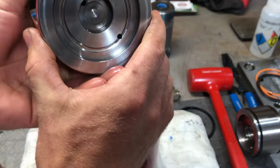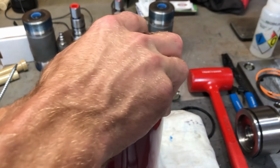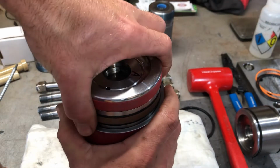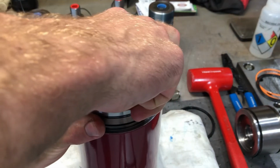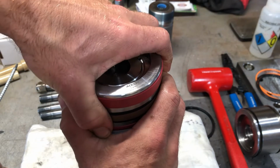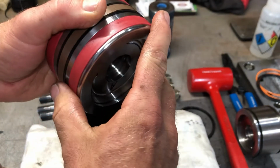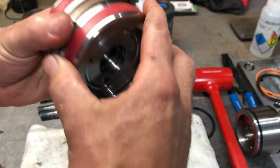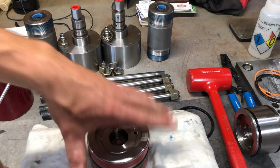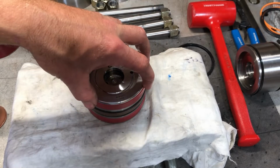Now if I flip to side B, so side B is down, and I slide this in there, first off, I immediately notice it's a little tighter to get it lined up, and it slides in. But now go to get it out. It comes out, but not nearly as easy as side A. I can just feel it, and it's hard to show feel on a video. I understand that, but measuring that difference really has me wondering, was this piston incorrectly manufactured?